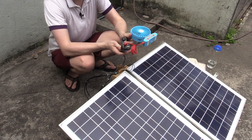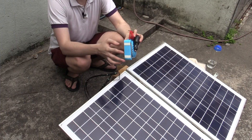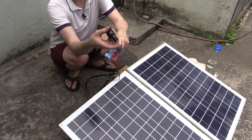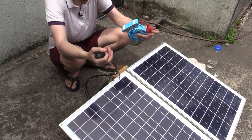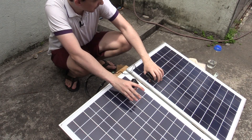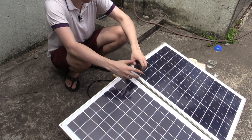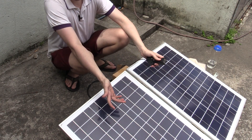A lot of people will say these are designed for 12 volts and you're going to break it. Well, they are designed for 12 volts, but the electrical system in your car can easily go up to 15 or 16 volts when the alternator is running, so they do have tolerance for higher voltages. This varies between brands and models, but these things are very cheap — maybe 100 to 200 pesos, a couple of US dollars — easy to replace and you can get them anywhere. So I'm thinking forget the lead-acid battery; mostly what they'll be charging is radios, cell phones, and other USB devices. They can carry this to the middle of nowhere after a calamity with no electrical system, and everyone in the community can plug in their device and start charging. It has to be during the day, but that's good enough.